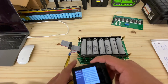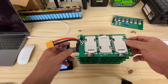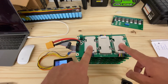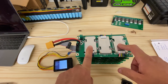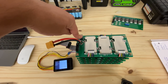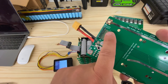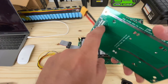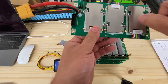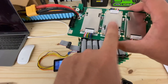So here's your BMS. If the BMS doesn't work and you can't get power out, there are several things it can be. It could be these fuses — maybe they're blown, so you've got to check these fuses. Then there are also all the trace fuses here. If any of these are blown, that means these BMSs will see a zero in any of the seven groups of cells. If it sees zero, that means there's something wrong with one group, so these will not turn on.